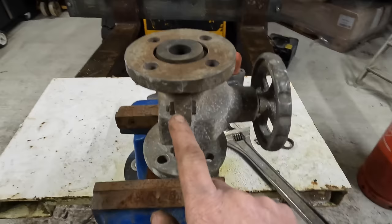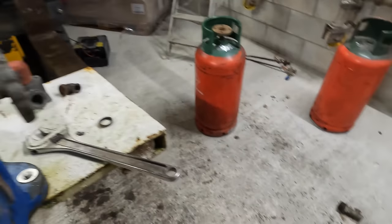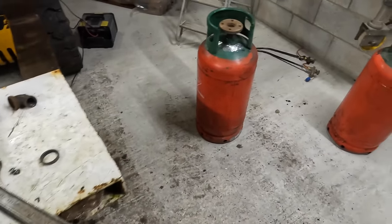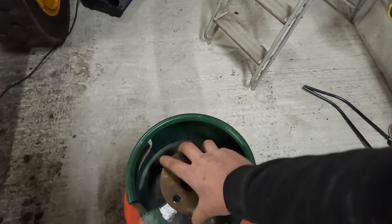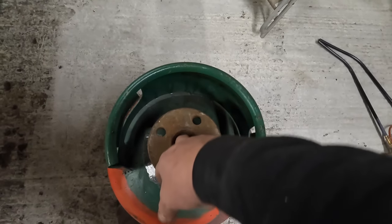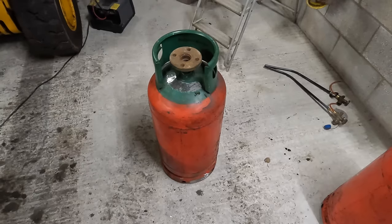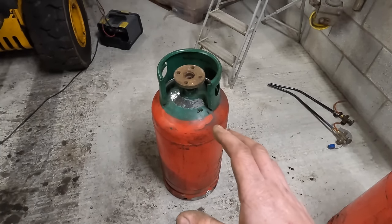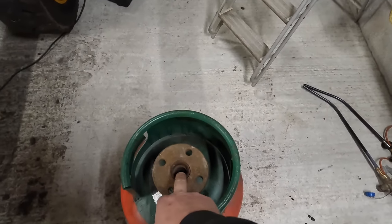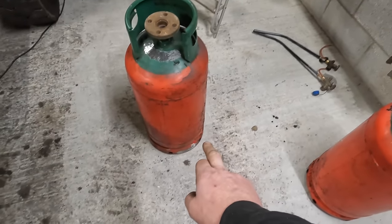So I'm going to crack this open, I'm going to make sure that rubber's good. I might end up putting that rubber in, I'll just have a look, see what happens. And then if I can build this, get some tape on this, get this all buttoned up, I'm going to get it so it's good for about 250 CFM, because it's going to be a 3/4 internal diameter, like obviously internal of that's 3/4, but that's only air, not the media outlet.